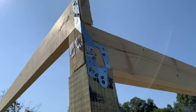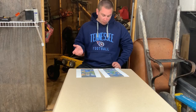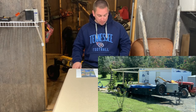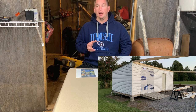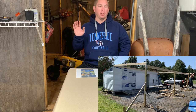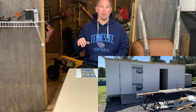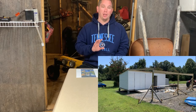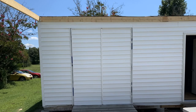Once I got to that point I was able to start working on all the rafters. On the shed side, all of them had rafter hangers on them. On the side with the posts, I put rafter tie-down strips on each one. So the rafters were secured to the board on the shed and they were also secured to the beam they were resting on as well.